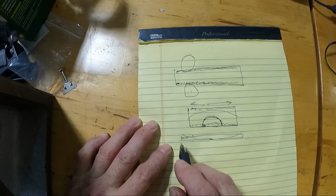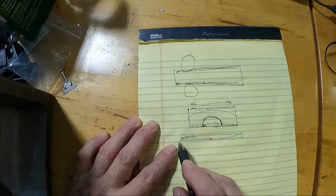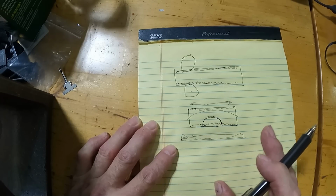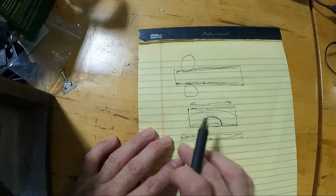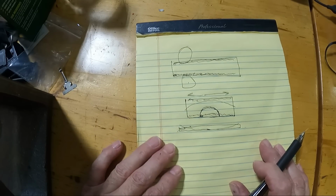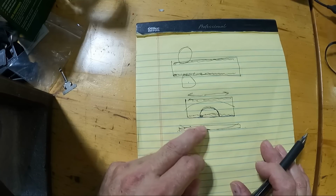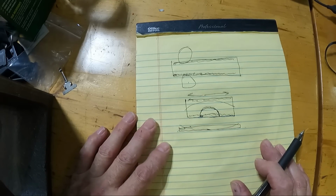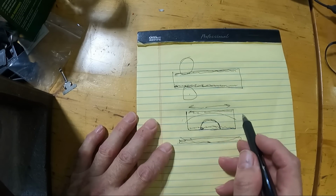And if you're really interested in holding something flat, oftentimes it's easier to do it using a smaller diameter end mill, because the end mill cuts cleaner. It's got more positive rake geometry than maybe a face milling tool has, and you take many passes over it, and you put less stress into the material. So that's another way to warp a part by machining it. You can either be relieving stress in the existing material or pushing it in yourself by the way you're machining it. So I did get that question: does it always move the same direction?